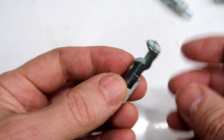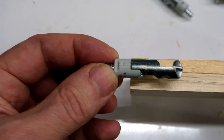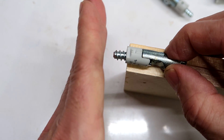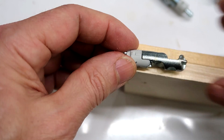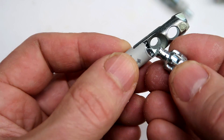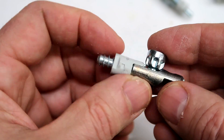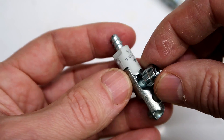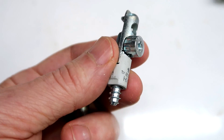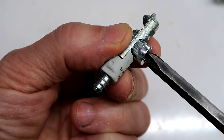What I found most fascinating is this particular fastener. It's meant to go into a hole on the edge of a piece of particle board sort of like this, and it sits in there like that. This screws into another piece of particle board this way. The way that screw is turned is kind of neat — there's this part here which is meant to be whacked into here once it's inserted into a hole, going through another hole off the side. And then to tighten these together you just turn this with a screwdriver.